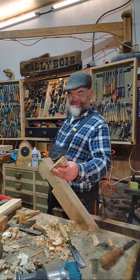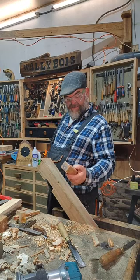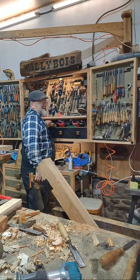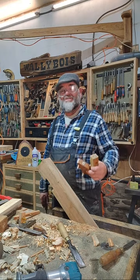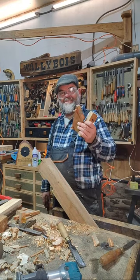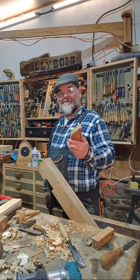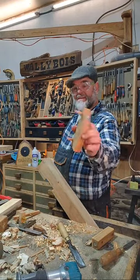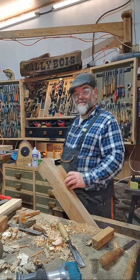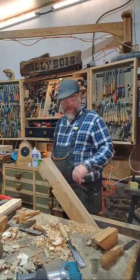It's just so good. It's just ridiculously easy for anyone to make. I wish I had one years ago because it just makes life easy. And the other thing is I've done a 45 as well. If you're on a building site and you don't have access to a chop saw, or you don't have to move it about and you've got one architrave to do around the door, this is the 45 degree version of that. Works so well. I was really, really surprised how well that worked. It's just one little neodymium magnet in there. I put a fence on there, made it easier to clamp to your bench or whatever. Or if you're on site, whatever. Yeah, it just works.